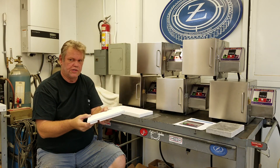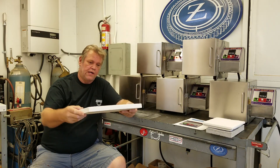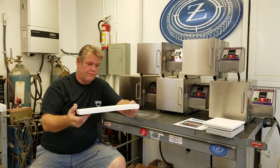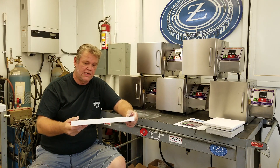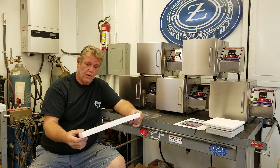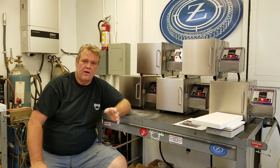I mentioned that the medium density board was really soft and parts drag across it easily. They asked why I didn't use a high density board — I didn't even know they made that. This high density board almost has a shell on it, it's a little harder to cut, but it's going to make a great floor. After the first eight are out and the precast bricks are depleted, we're switching to a high density board floor. It's easily drilled, you can put pins in it to stand parts up, and it's removable — it just slides in and out.